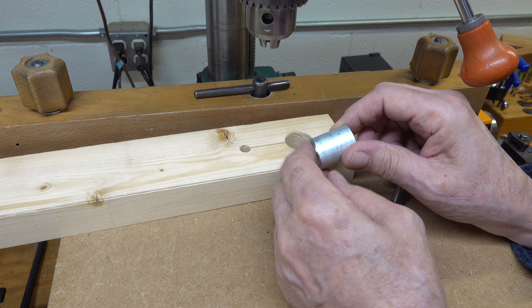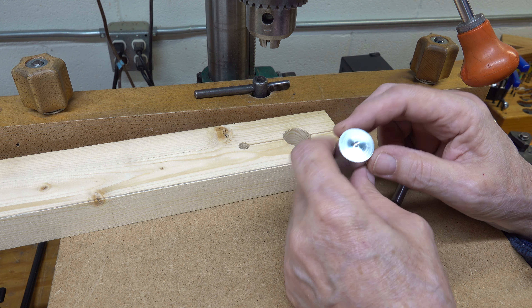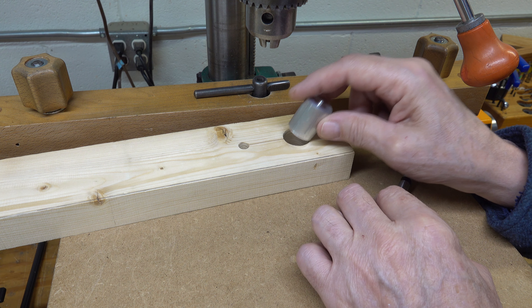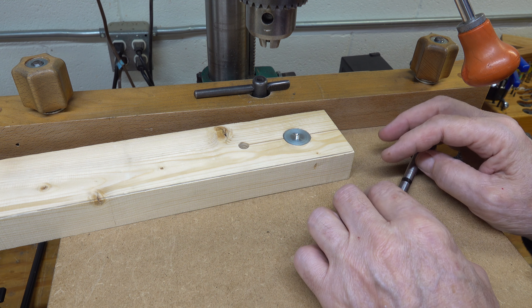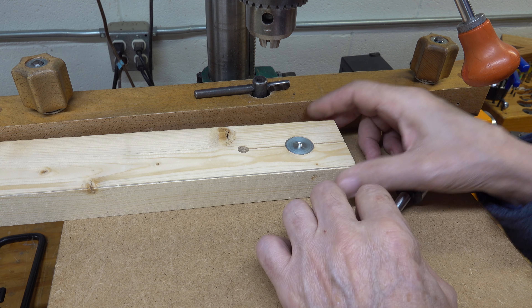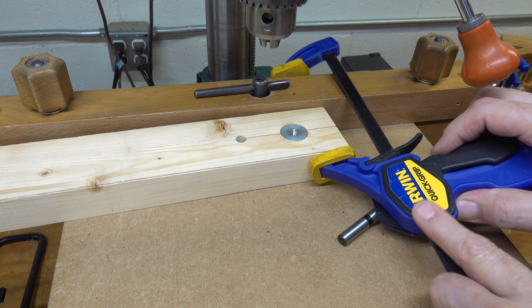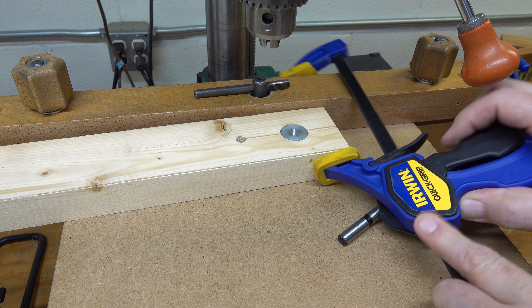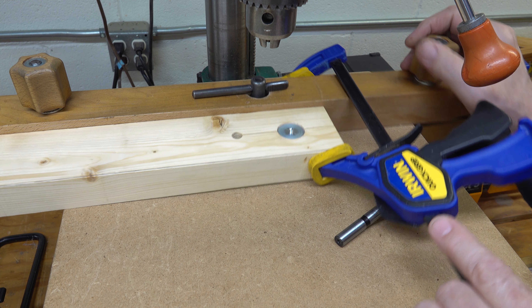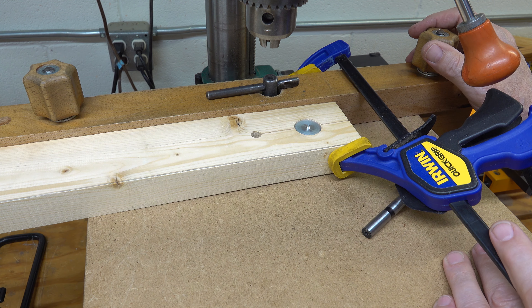For this next tip, let's say you have a part that's a little smaller than the hole in your fixture — it's a radial part that drops in, and the little wiggle in there is going to be a problem. So if you cut a slot and then pinch it with a clamp, your part is now locked and you can move your fence around.